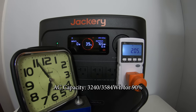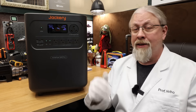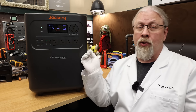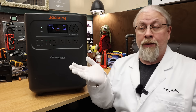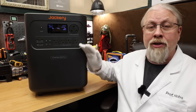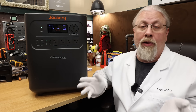We took the product into the secret lab and performed all kinds of tests. As for the AC battery capacity test, it scored 3240 watt-hours out of 3584 for a rock-solid above-average 90%. For the parasitic drain standby test, we're changing how we calculate this because there's a lot of discrepancy between MPPT controllers when recharged via the DC port — some are very efficient, while others are not. So we're going old-school, using the percent display to factor idle consumption, and recharging via the DC port to gauge MPPT efficiency.